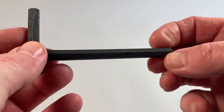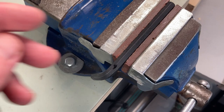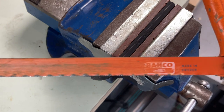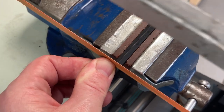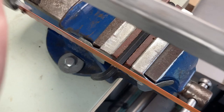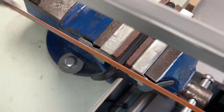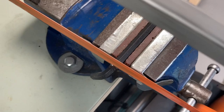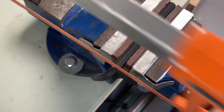This turned out to be a really high quality piece of steel. The next thing I wanted to do was to lose the corner — I only want the straight bit of the Allen key. I thought I would be able to saw through it, which actually proved really difficult. If I had an angle grinder I could use a cut-off disc, but I don't and I don't want the dust and mess in the workshop. So I took a hacksaw and it turned out to be a really tough bit of material. My hacksaw blade got blunted, so I turned to brutal measures and snapped the end of the key off once I'd sawn about halfway through.